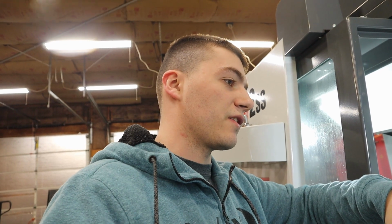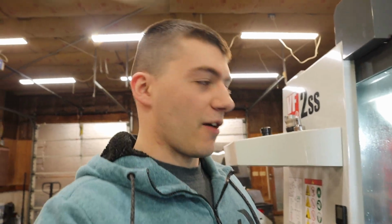Alright, as stated, I'm not very lucky with heights, so it's like 371, and it's supposed to be 375, so that's 4 thousandths, like a human hair, so that's kind of bad. But I'm going to continue forward. We're going to see if I can polish that ledge out. If it's still within 5 thousandths, because that's the tolerance we got on everything except these bores, then we'll continue on with the part, and I'll just have to live with it. Somebody will have to live with it. But inevitably I'll probably screw something up down the line, so we'll have a chance to fix it anyways.